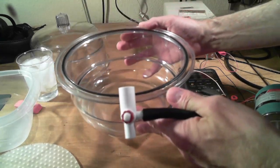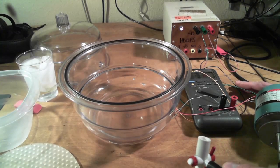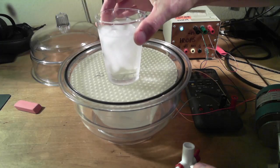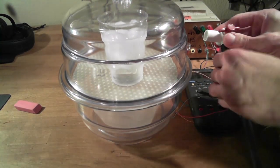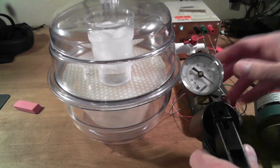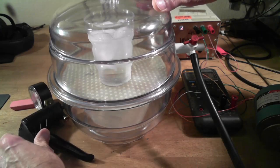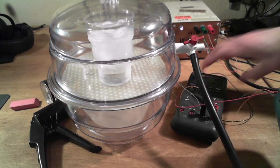We did a pretty good job cleaning up the vacuum chamber. When I was describing what's going on with the marshmallow fluff, I mentioned that the moisture in the fluff is boiling. What exactly does that mean — how can we boil water at room temperature? Well, let's do an experiment. I'm going to take a glass of ice water and put it in the vacuum chamber and draw down the pressure and see what happens. I took off the other pressure sensor because it only reads down to about minus 30 inches of mercury, and we need to operate around four millimeters of mercury — a fraction of an inch — before the ice water will start to boil. So that gauge is no good. What are we going to use instead to get a quantitative measurement?